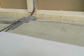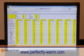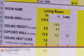Note: the tile floor heating mats cannot be cut or notched to fit around any obstructions or penetrations, such as door openings or floor registers. A heat loss calculation must be completed if primary heating is desired to determine the energy required to adequately heat the space.